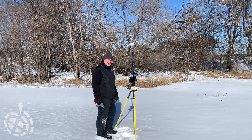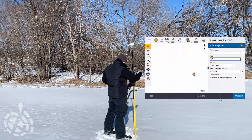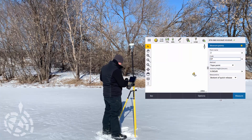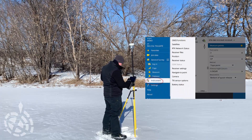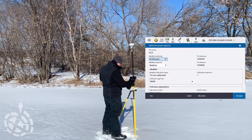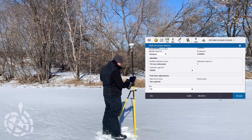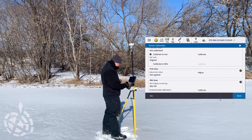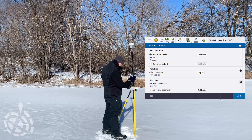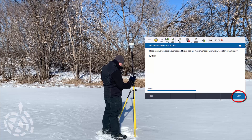Let's jump in and take a look. We're going to go under instrument tilt sensor options — you can see the bias adjustments here. We'll go under calibrate, then into IMU bias for this one. Go ahead and hit calibrate and start that process.